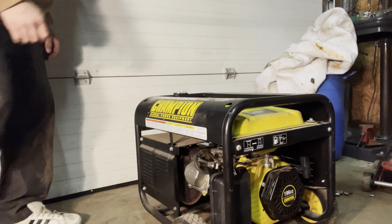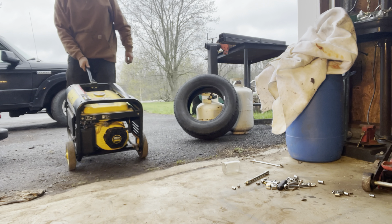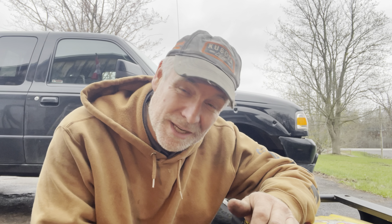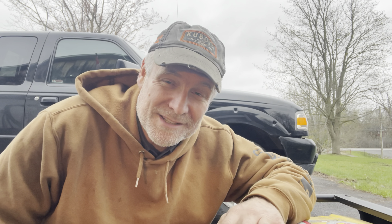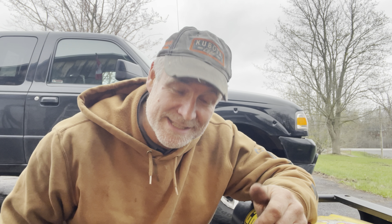Turn on the fuel. So we got the carburetor installed. Now we have to make sure when we get it fired up that it's not charging more than 120 volts. Putting a carburetor on a generator is not like most other things — you need to verify it's not charging more than 120. Because if you plug in your stuff, you're going to fry everything. So after installing the carburetor you really need to spend some time and verify the voltage. If it doesn't have a gauge built in, you need a multimeter — even a simple cheap one. Let's fire it up and check the voltage.